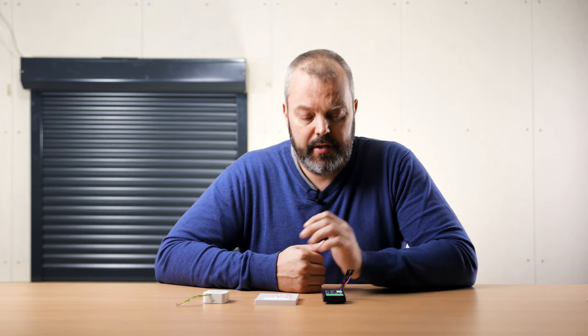A big advantage of the module is that motors of any brand can be connected. So you can turn any brand motor into a smart one, even without it being a Somfy motor. The only thing it needs to be is a 230V motor, and it has to have a separate up-and-down wire. But apart from that, you can use any motor. There is one limitation with regards to the type of motors you can use, because there's a maximum of 80Nm of torque that you can connect to the module. It's also 2A max for this receiver, but in practice you don't really need an 80Nm motor for a regular awning or shutter. Plus, most motors are 1A, so you don't easily get to the 2A maximum.